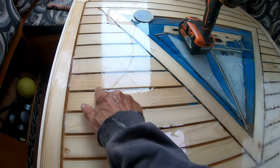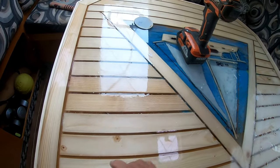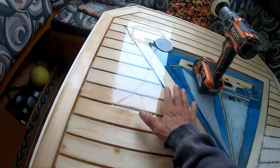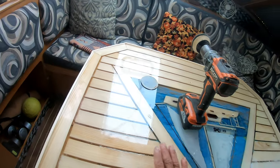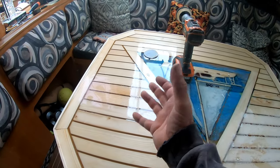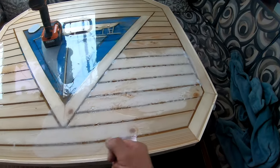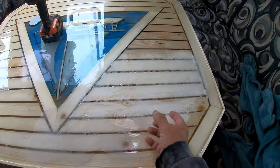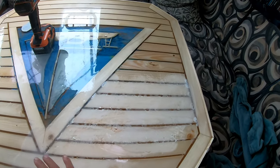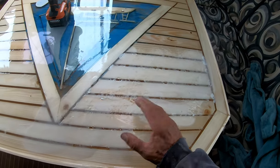It's got actual low spots in between where things popped and it wasn't able to level itself. That's not good — still manageable, not ideal, but manageable. Sand it, give one last coat of a fine epoxy over the whole table and that would have taken care of that. But as I'm heating it up over here and trying to work these air bubbles out, even though I kept seeing it kept popping, I worked my way over to this side of the table. As I'm heating it, I'm seeing bubbles and popping them out going this way, and by the time I get here the whole back is loaded with bubbles again. I'd hit it again and again. No matter what, bubbles just kept building up. This was the last section I did — building up — and it's like, okay, this is not working.